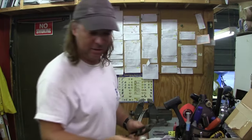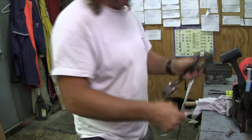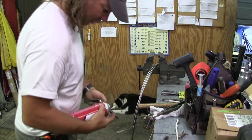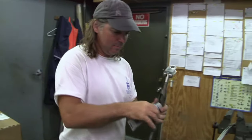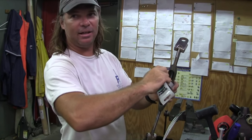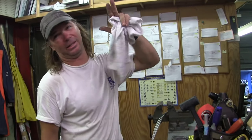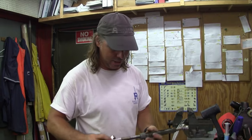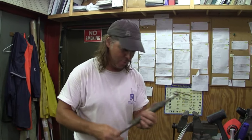This is a wire bristle brush — a little nylon bristle, an old toothbrush, sometimes fits in a little better. At that point I'm not getting corrosion out, I'm just knocking the debris out of it, basically restoring this back to its former glory. I'll take some Super Lube, put some on my finger and wipe it right there. Then as I tighten the rigging, it draws that in. For a normal static tune, you do not completely disassemble everything — you're just tuning it. It's usually because someone says the mast is really leaning off on a starboard tack and they just need a quick adjustment.